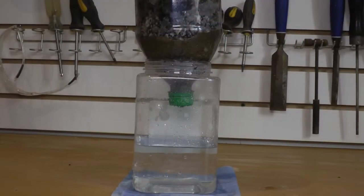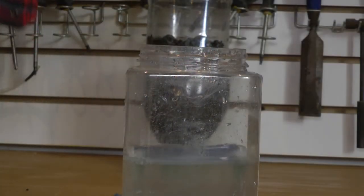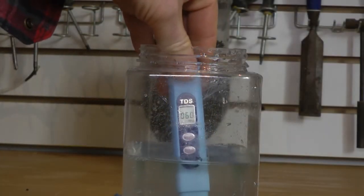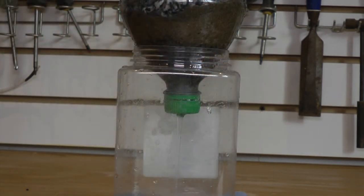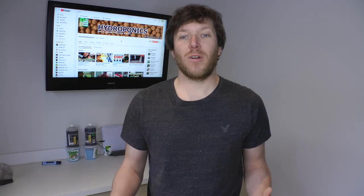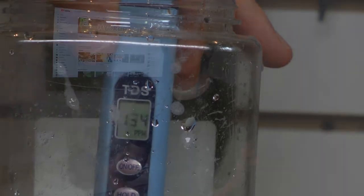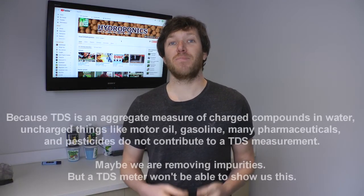Tap water had a much higher TDS reading, so there'd be more chances of actually filtering impurities out. I thought I was seeing results — and I did, until I tried to repeat the process and realized I wasn't seeing results anymore; it was the same reading I started with. It took me a couple minutes to figure out: all I was doing was diluting the tap water with the previous rainwater in the filter. This was further proved when I added rainwater after having tap water in there — my TDS rose because it was saturated with tap water — and then adding tap water again just diluted it back down.